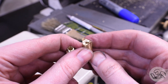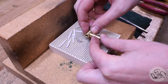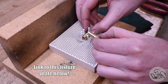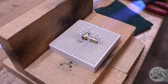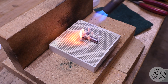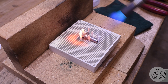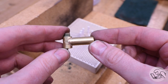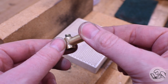That was a lot more work than expected, but the end result is quite good. The ends of the brass got pretty thin and started to flare out a bit from the cutting, but otherwise it worked out quite well — we got a good fit. Now for silver soldering. Fixturing a part like this could be very tricky because it's so small, but this is a ceramic jeweler's fixture plate — shout out to Robin Ranzetti for showing me these things. It's an excellent way to fixture little tiny parts and hold them perfectly still while you silver solder them. Flux on, torch on, heat it up — you can see how the ceramic pins and plate really take the heat. Once the flux gets watery, touch the silver solder in there, maybe a little more on the other side. Heat it a little longer to make sure it's all flowed well. Once it's cooled to black, quench it in water — that really helps keep the scale and mess from sticking. Don't quench it while it's still red or you'll wreck the silver solder joint. Then clean it up to a dull finish with Scotch-Brite. You can go the extra step and polish these if you want, but they are going to tarnish over time no matter what.